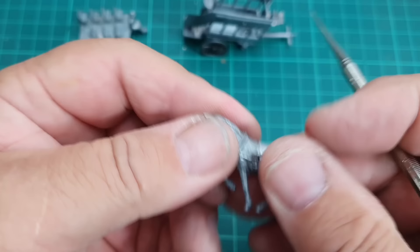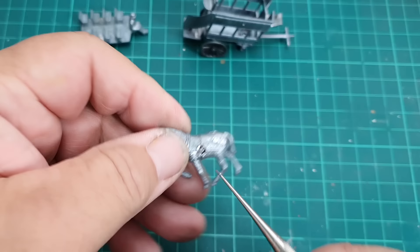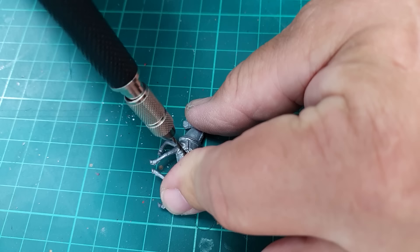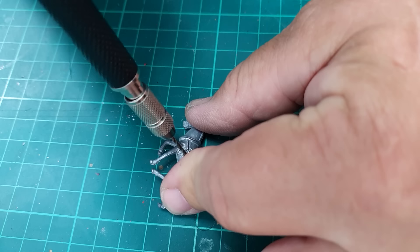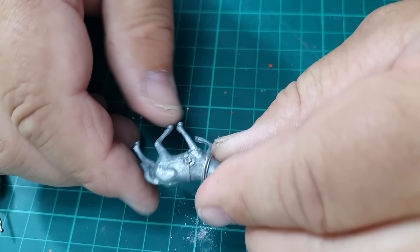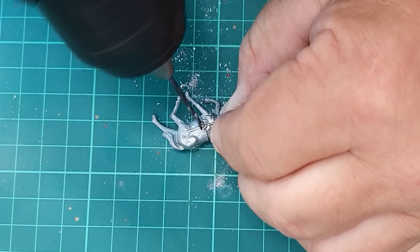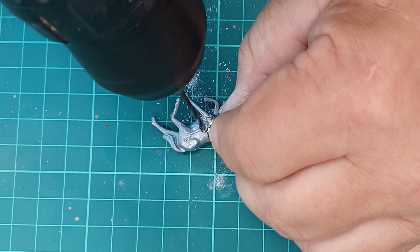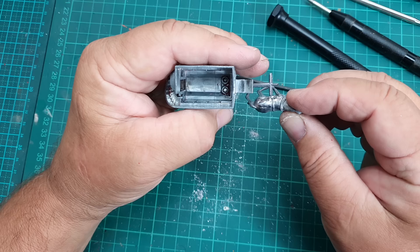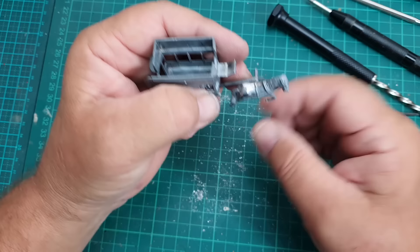I clean the flashing off with hobby files. This pin is broken off the original drawbar and jammed in there - I try to get it out with dental tools and map pins but it's not happening. So I adopt a little hand drill and drill a very small hole where I think the center of the pin is, intending to drill it out to the correct size. I'm a little off target, so using the drill I make some corrections. I clean off the edge of the hole with small hobby files - just got to get myself a second horse and this will be ready to roll.